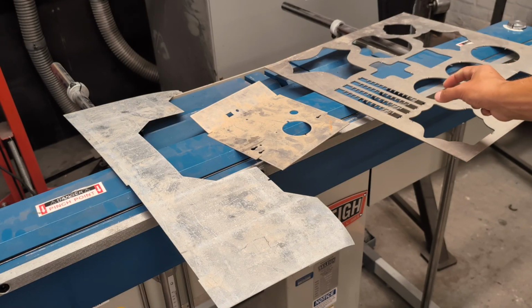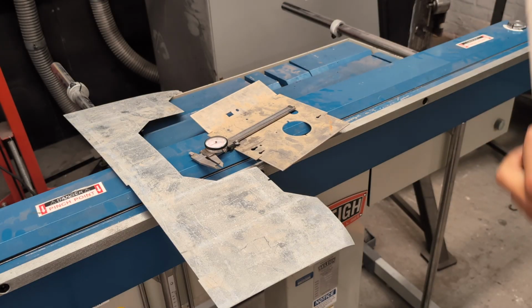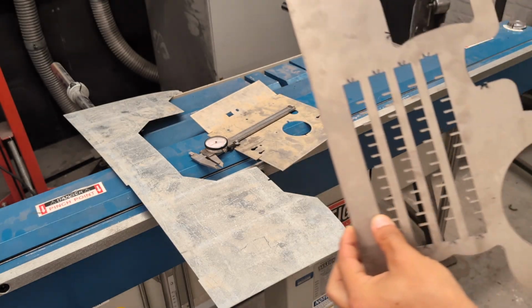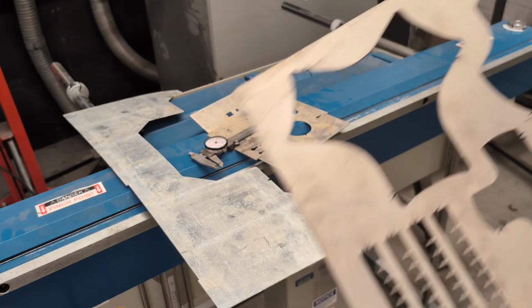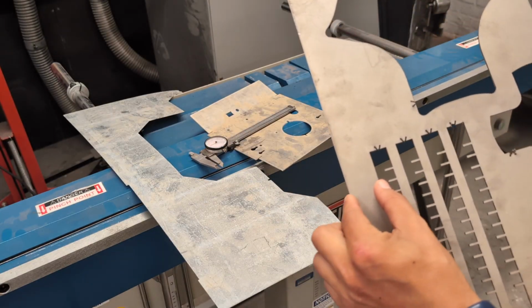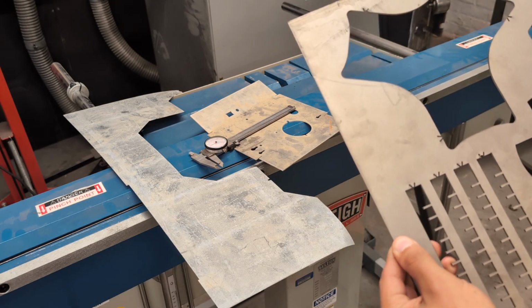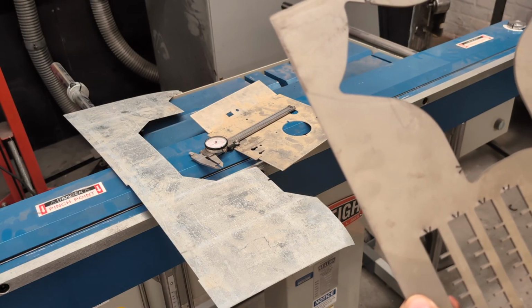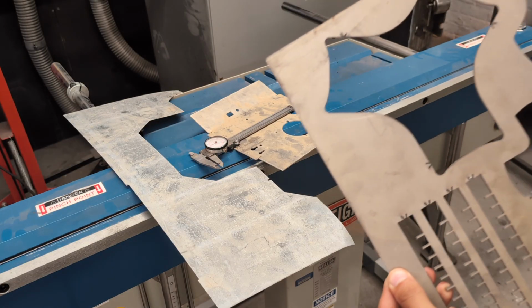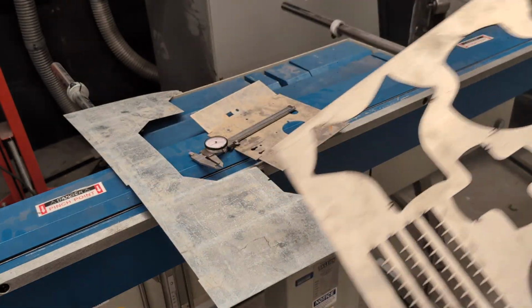Now, if you were just doing a narrow strip of it, for example, if you just wanted to bend a strip this wide and you used a wide finger, the machine might be able to do that because it'd have a lot of material to hold down on that big finger, but only be bending a narrow width of this material. So it's not a hard rule. And luckily you won't damage the machine if you try to bend something too thick. You just won't get a good bend. So we'll take this one out of the pile and we'll bend these two.